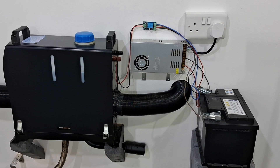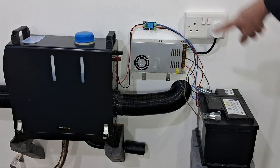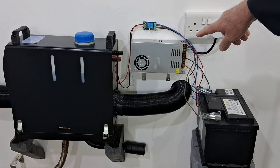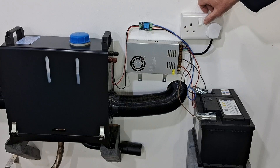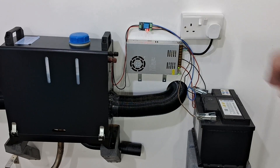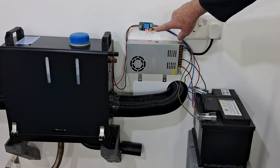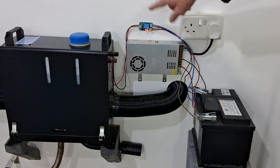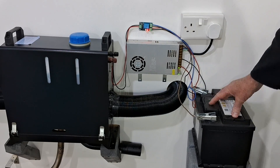Now for the next part — you've had your power cut, so what happens when the power comes back on? This is supposed to switch from battery power back onto the 12 volt power supply, so we're going to try that now. The power cut is over and the power is coming back on — that seems to have worked perfectly. The little power light has come back on and the automatic switcher switches to the preferred mode, which is the 12 volt power supply.